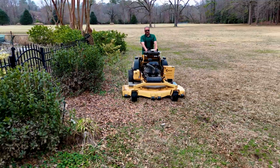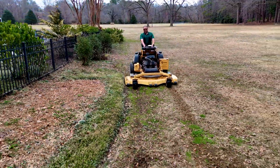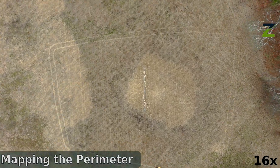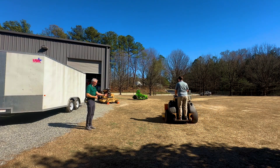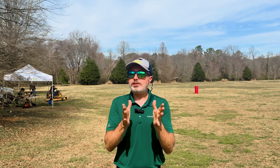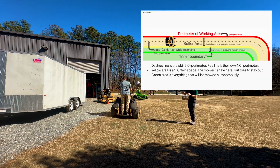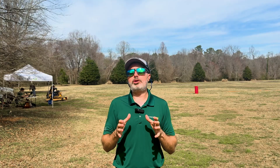This is thanks to our work together on several safety standards bodies to ensure that autonomous mowing is safe and efficient. Let's map out a job together to see how it works. We now use the outer deck to record the working area. Previously, we used the midline of the mower and told landscapers and operators to leave at least two mower lengths, or 10 to 12 feet, as a buffer area for turns. This isn't necessary anymore. Now, with 4.0, you define the working area with the outer deck of the mower, which allows you to define the perimeter precisely.